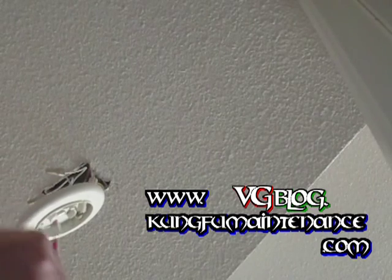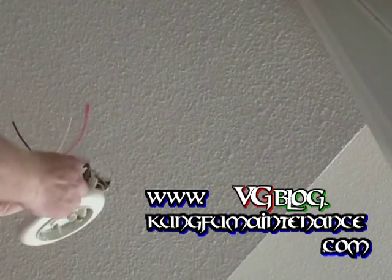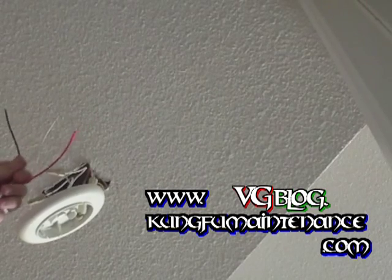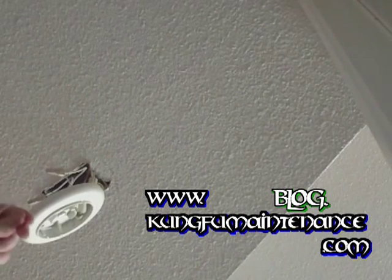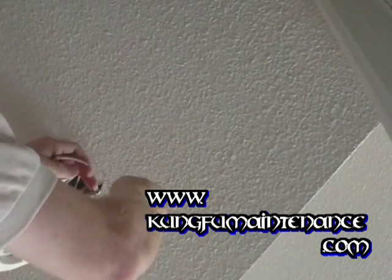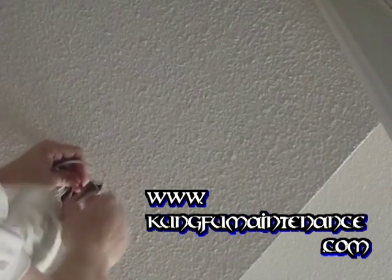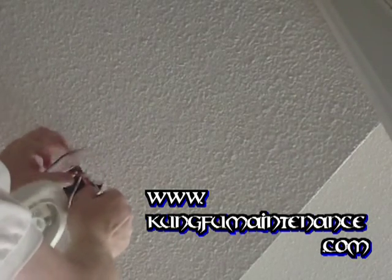What I have here is our new pigtail. You can see how the red one's capped off, and that's for an application where you had a unit that didn't have other smoke detectors hooked up — but this one does. So we're going to pull this cap off so we can hook up the wire to the secondary. We're going to hook up our wires here, and you can wrap these a little bit or just stick them together. Make sure that you can tug on your wire a little bit and confirm that's solid.